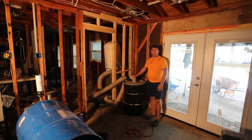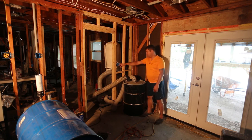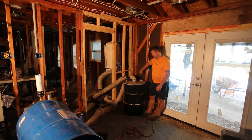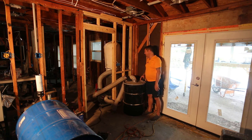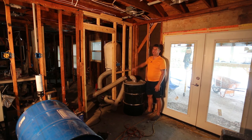It's acting as a particle separator at this point, and it is catching the vast majority of the junk that gets sucked up, and it just helps reduce the load on the dust collector. This is the inlet — there's a 90 here and a 90 there. It circulates the air and causes the particles to drop out, and then whatever's left goes into the regular dust collector, through another cyclone.